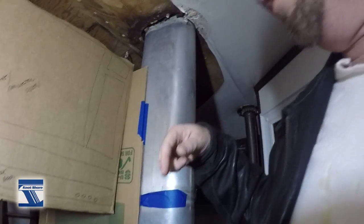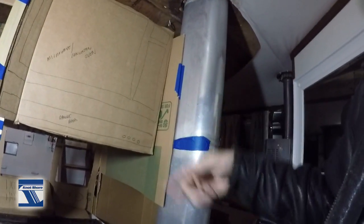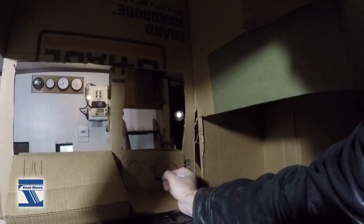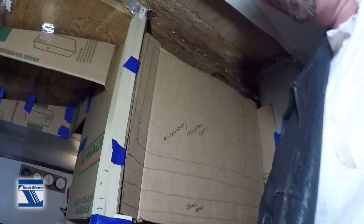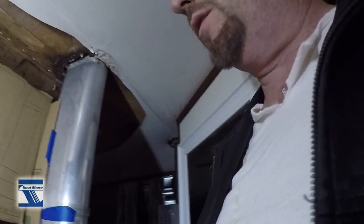And over here will be the two water meters for the two water tanks, which we're going to get into tonight. And that'll be a switch for the propane. The propane has an electronic switch all the way at the tanks in the back of the boat. On top of the deck there's a dock box, and that's where the switch will turn it off and on. I want to put a flashing LED probably right about here, so that when the switch is on it lights up, but also the flashing light will go on saying, hey dude, you left the propane on. Because you don't want that stuff leaking down to the bilge, because it's heavier than air, so it will make its way down to the bilge, and if you get a spark down there, boom, bye-bye boat. So you want to make sure to avoid that.